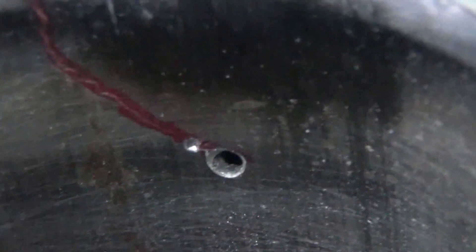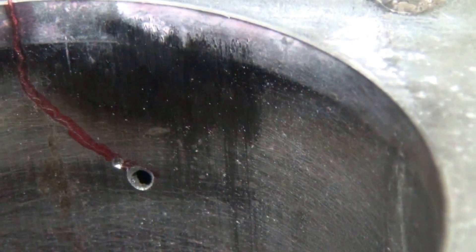Not a full chamfer, just a little counter-cut on that, because the pin is going in at a heavy angle — it cuts up on the top of the hole, not too much on the bottom. That gives a little bit of room for the pin to go in at an angle. At least that's the theory. Go ahead and tap this, then we'll put a pin in it and see what it looks like. There's our first pin in there.